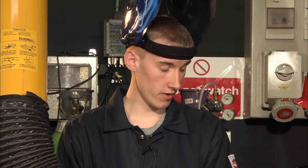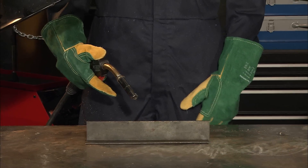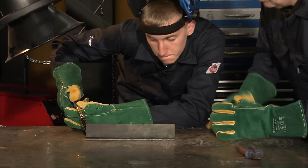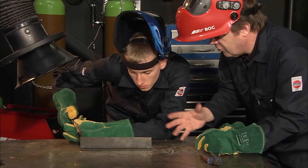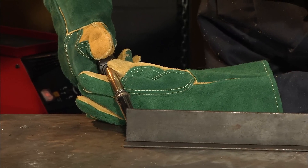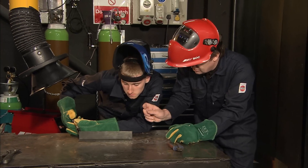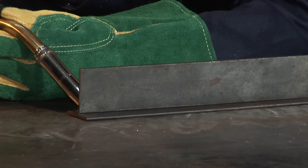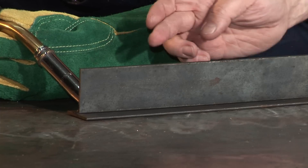Now Mike, we've got direction. Now angles. If you would like to get comfortable where you think the torch might be — and we'll set off the work piece so it's running parallel to you. Now if you look at the back of the torch, you've got a flat there. So if you keep that one flat to the work surface, that's generally about right. And you set the torch back at a slight angle and make sure that you've got good visibility along the length of the joint that you've got to weld. And you need to make sure that you stand off about 20mm off the work piece itself. Work piece to the end of the contact tip is about 20mm. That looks fine to me. It would be good to weld.